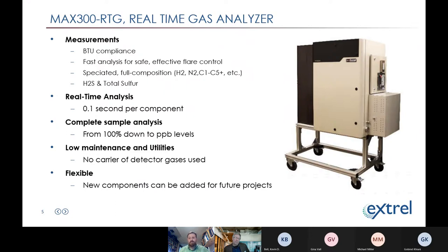For compliance parameters, the mass spec calculates total sulfur or net heating value BTU from the individual component concentrations. Unlike a GC, the mass spec has a set dynamic range for all components — from the PPM level, sometimes PPB, up to 100%. That was a good fit for flare gas, where the vent gas composition can change very rapidly. The mass spec does a fast measurement: 0.1 seconds per component, so in a flare sample measuring 10 to 20 things, that's one to two seconds per update — much faster than a process GC taking 8 to 15 minutes.